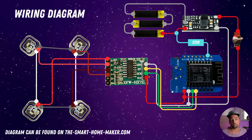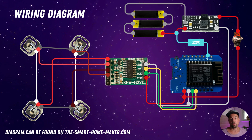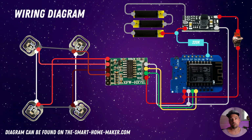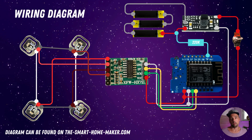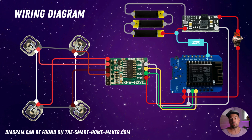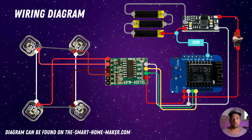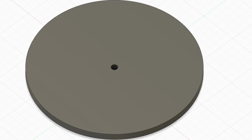And I have also added a wire that goes to the analog input of the D1 Mini, and we use this in order to measure the voltage of the batteries, and by this identify whether the batteries are still full or already empty, because I think this is very important to know. Otherwise you have this device sitting outside in your garden, in your barbecue grill, and you never know when the batteries are empty.